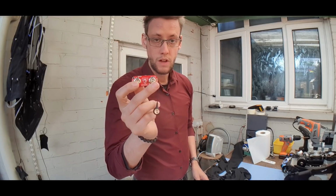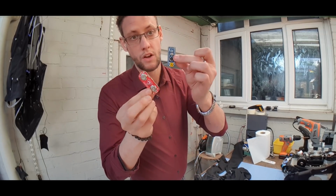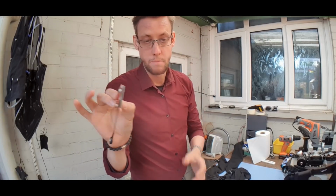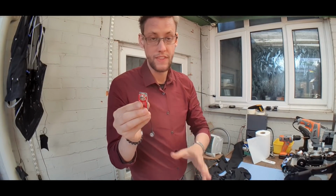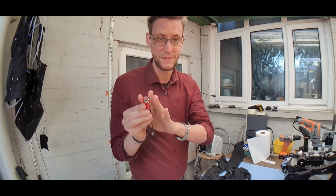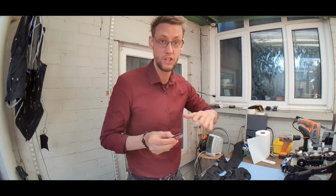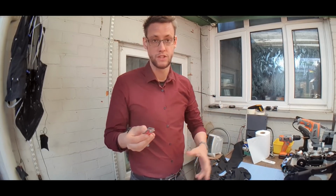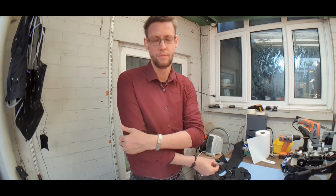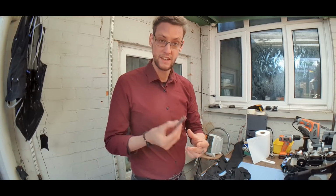which is actually the muscle sensor pickups and the myo sensor itself built into a single board, which would mount to an Arduino Nano, and they'd just be shielded together like this, effectively mounted to one another. That would be able to pick up the muscle transductance, convert it to a digital signal, process it in the Arduino Nano, and output it as a digital signal that can then be output to the respective servo, linear actuator, or electroactive polymer muscles respective to whichever joint it is. So that encompasses all of it.